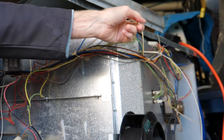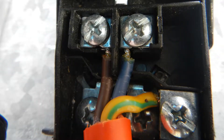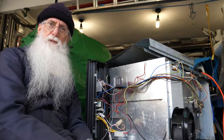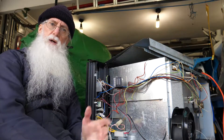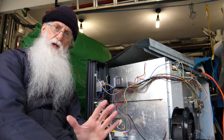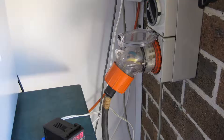At the back there you'll see the big orange cable — that's to the 240. This was originally wired into the wall so it didn't have a plug. You need a power point with 15 or 20 amps to handle the power. Your normal lighting socket in the garage may not be strong enough. Check with your electrician that you've got enough capacity to pull the current. I've had special 20-amp, 30-amp wiring put in, so that's why I can use it.